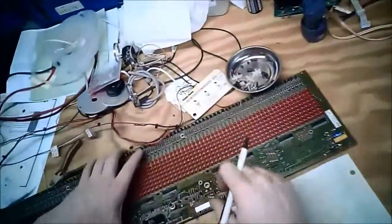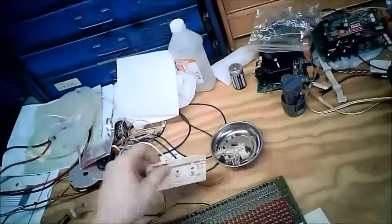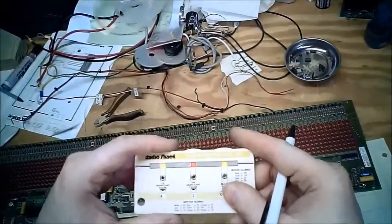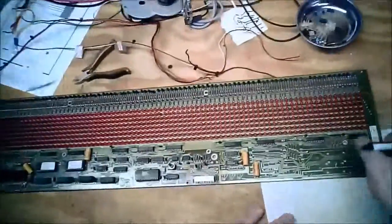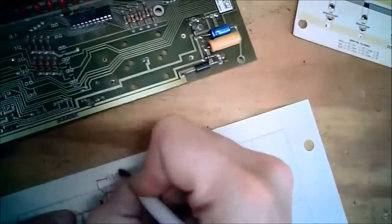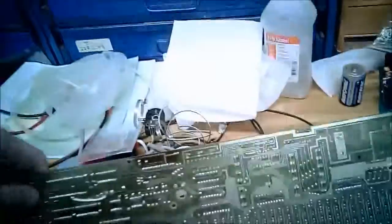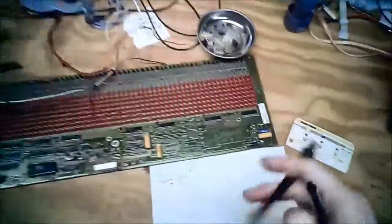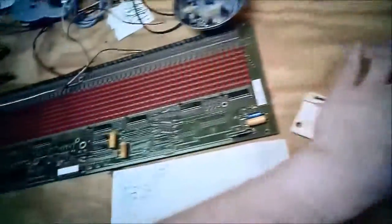So anyways, let's start following it through. So the collector side of the transistor, yellow, purple, orange, 47K, yellow, purple, yeah. Nice, no other connection at the top. That goes over to that guy, who then hits the 5 volt trace. At least I'm pretty sure that's 5 volts. At that point, and beep. Yep, so that goes to 5 volts.